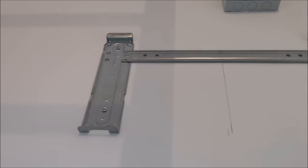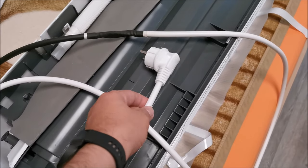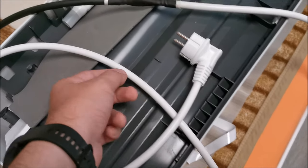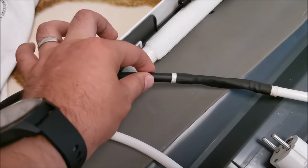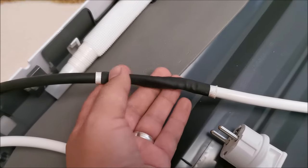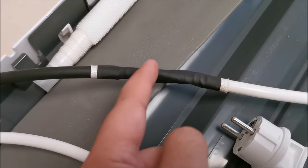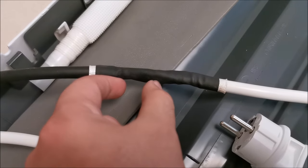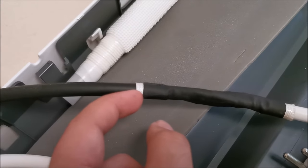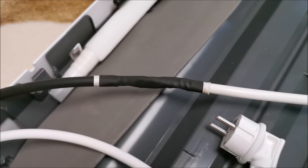Make sure you have the middle of the AC on the wall marked, and the middle of the support marked too. The support is now on the wall; we just need to measure and mark where the hole goes to get everything to the outside. I extended the power wire — this extension is 2.5mm² wire, which is actually thicker than the existing 1.5mm² wire. If I'm adding something, I want it to be stronger.